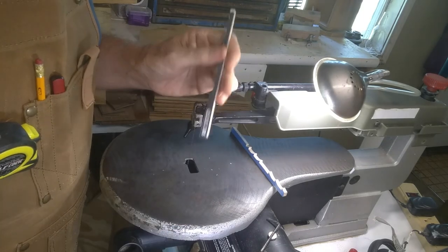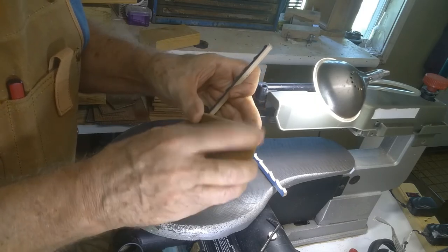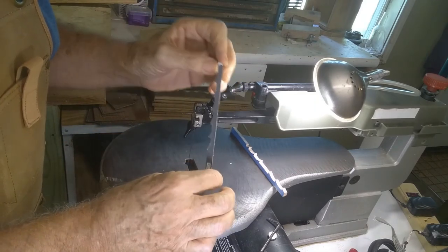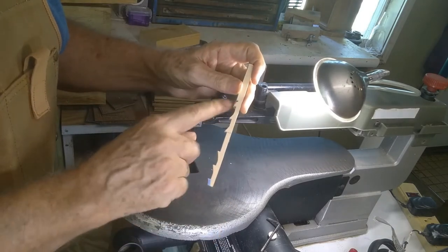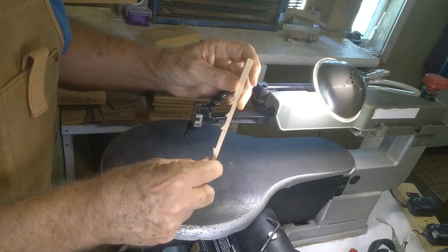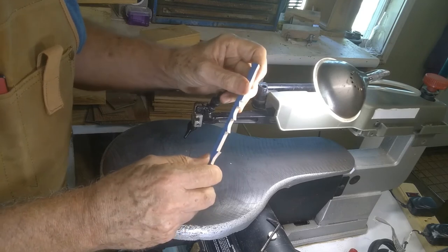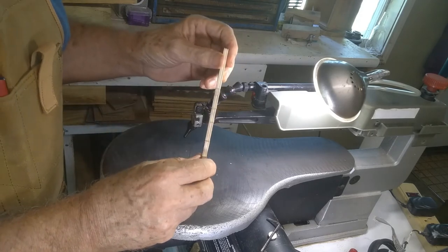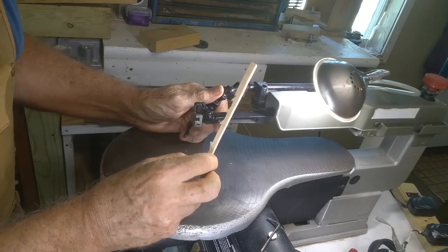The skip tooth is more aggressive and really good for hardwoods and real thick projects. I cut stuff out of a 2x4 occasionally. I cut this with a skip tooth blade — it's layered oak, a little box I made out of scrap. The next step up from skip tooth for me is a reverse tooth blade. It's also a skip tooth, but the bottom one-third to one-half of the blade is reversed upward so that it cuts the bottom of your work on the upstroke. You have to make sure you're holding your material down on the table when using it.